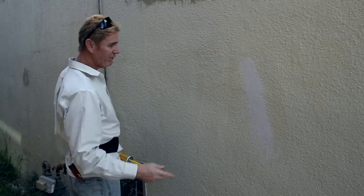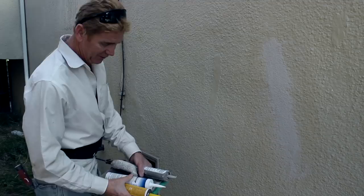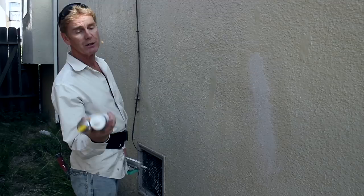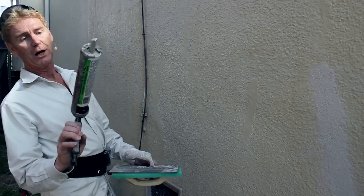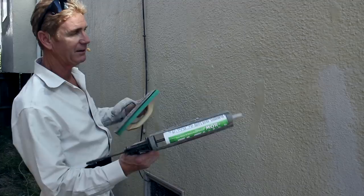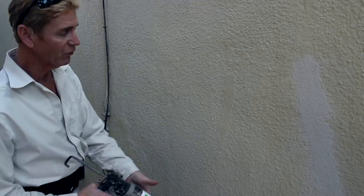I showed the fellow how to do it, and it's just with a caulking. Now these are great caulkings here, but they don't have sand in them - these are polyurethanes, they're really good for what we do with paper and wire. But I'll show you something that works really well. All you need is a tube of Moreflex - it just has sand in it, it's an acrylic with sand in it. Take this one patch right here - what somebody did is they put caulking here and just used a trowel, so it's a sore thumb all the way around this house.